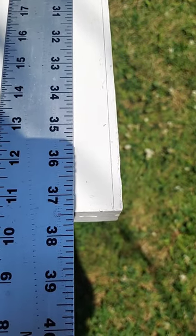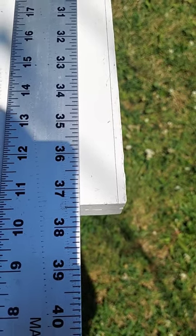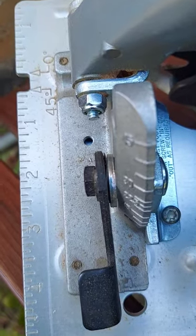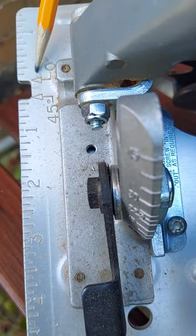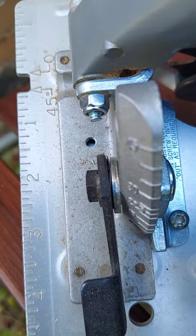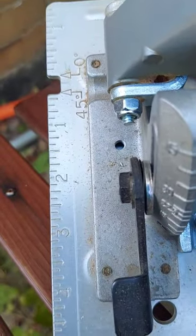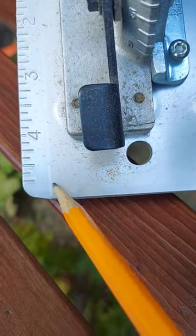So I made my mark. I only want to take a quarter of an inch off of the bottom. You see where this zero mark is right here on the circular saw? That's where your cut line is going to be. So you want to measure another line from your quarter-inch line — you want to add five inches to that, to right here.